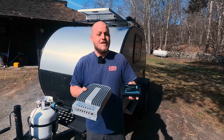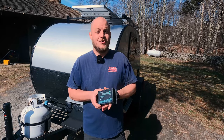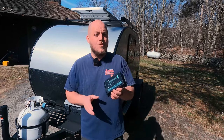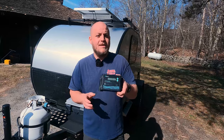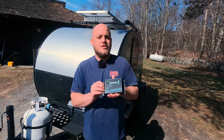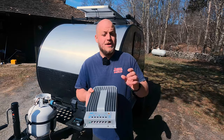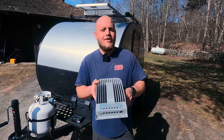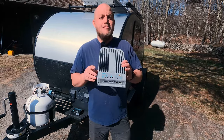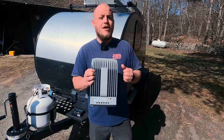Next we have to choose between the two different types of technology available. It might surprise some people that I'm going to be going with a PWM charge controller. This is actually going to give me the most performance for the money. A PWM charge controller provides a multi-stage charge to the battery and most importantly steps itself down to a trickle charge when the battery is full. An MPPT charge controller — maximum power point tracking — is usually the better option. They cost a bit more but deliver a more efficient charge. In most cases when installation method isn't a factor, an MPPT will pay for itself. It's a good upgrade.